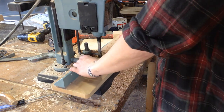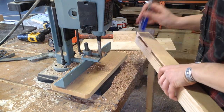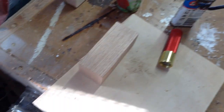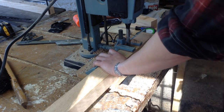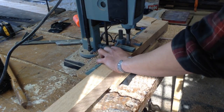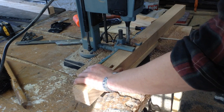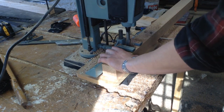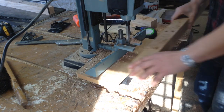I could go through and do one edge of these pieces. This is pretty simple work with the mortising machine — I have a three-eighths inch bit in there. I went pretty deep down the sides of these, so the front is going to get side-by-side tenons. The bottom of this piece is going to have an open shelf and the top will have a drawer, and she wanted them both to be exactly five inches wide for the opening. Since these were spaced evenly, I could do one side, flip it, and do the other on the mortising machine without having to actually move the fence — makes the process a little bit easier.